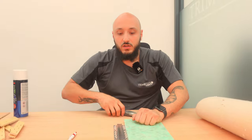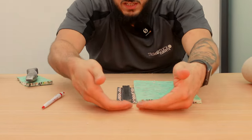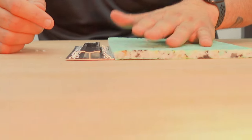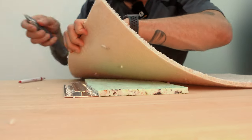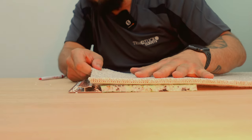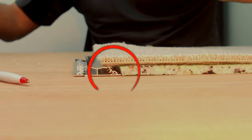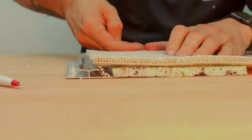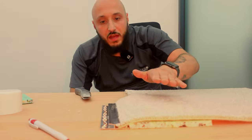The door bar's in place, the underlay's in place, and the carpet has been laid out. So now the carpet is ready to be tucked in. You can see there's a void within that area - can you see that? Now if we tuck this in, secure the carpet down so there's no issues, and then tuck it in, you can see that it's sloping down.